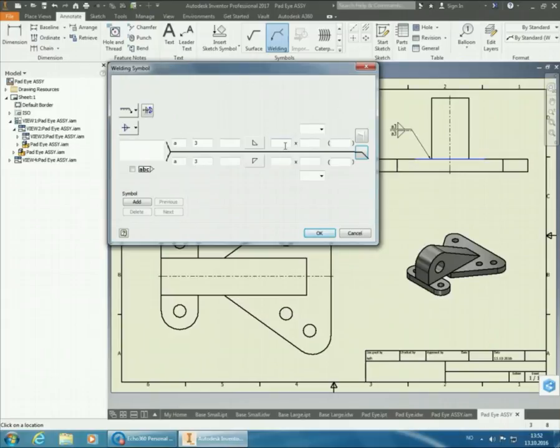So you could calculate exactly how long of a length of weld you're going to need to get the necessary strength, and you can put it in as, for an example, divided into 4 pieces that are going to be 40 millimeters long. So then you could put in 4 and 40 millimeters. So then you would know that you would space out across this total length where you're going to weld. You're going to space out 4 different welds that are going to be 40 millimeters, instead of doing a continuous weld along the entire line, which would definitely be strong enough, but it will also take a lot more time than just doing sections of welds along it.